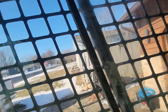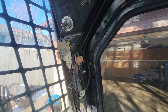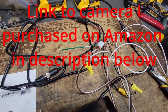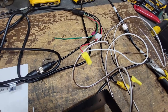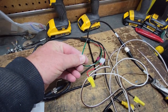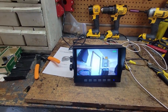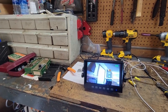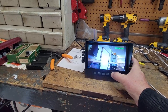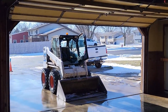I could run the wire right in the back, and I've got power coming here to the switch for my flashing light on top of the cage. I've got the camera hooked up to a 12-volt battery just to demonstrate. I'm going to hook it up to ground and positive, and tie the positive in with my flashing light on the roll cage. I'm not going to bother hooking it up to reverse — I'd rather just have it so when I turn on my flashing light, this will power up. I can just hit the power button and I've got a camera view of the back. I messed around with this in the basement to change the lighting for dark conditions. I'm going to take all this down to the Bobcat and see if I can figure out where I want to put things.